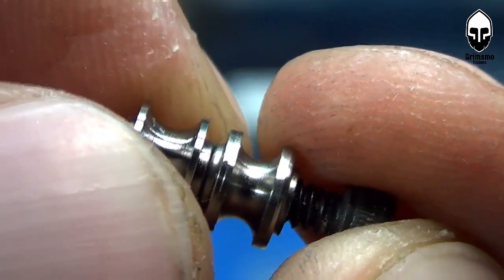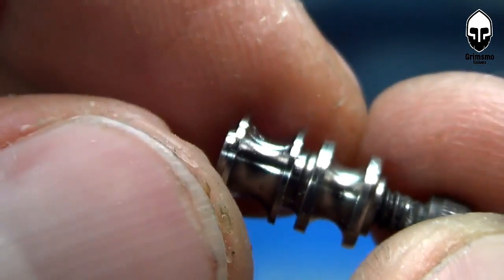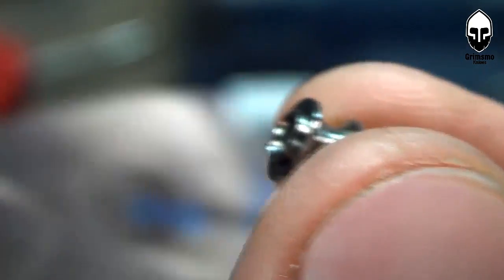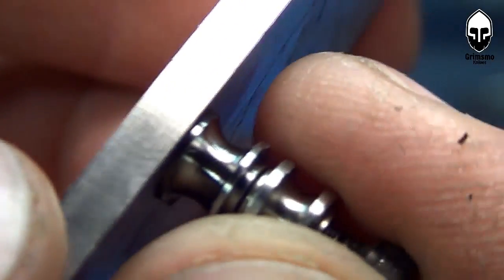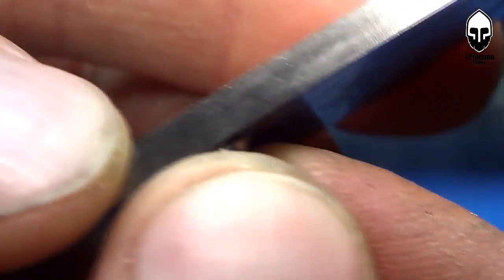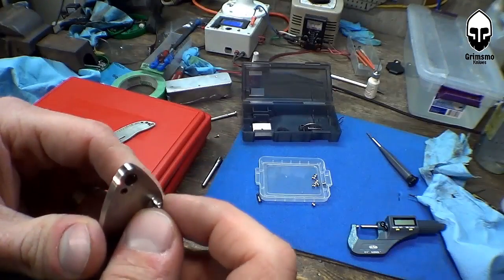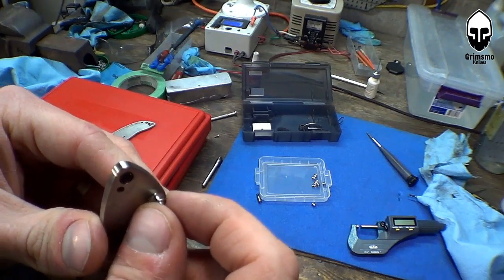That radius on the shoulder made me put a huge chamfer on the handle hole to make the spacer go in there, and I didn't like doing that because these shoulders are short enough to begin with. They also made the dish not as wide as I wanted, the shoulders are too wide, and there's a little undercut lip — just all kinds of wrong with these. They worked; the knives that use them are fine. But mine are 100 times better — crisper. And I'm pretty sure they didn't use 6Al4V titanium like I told them to, because they don't anodize the same color as all our other 6Al4V parts. Here's a handle with a hole in it — I just put a tiny little chamfer in it, and the spacer goes right in like butter: no slop, fits perfectly. It's a perfect slip fit, and if it's not I can tweak the tolerance until it fits even better.